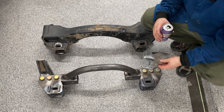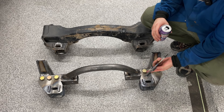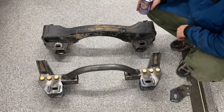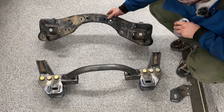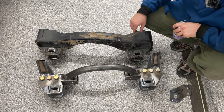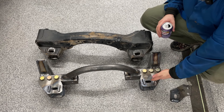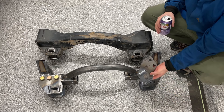This is held on with bolts. This is the rear example, and it will be held on by two bolts just because of access in the back. These things now bend — they take the place of the original cam tab setup. And when these things bend and bend a lot, you can replace it, because this whole subframe yielded and twisted, not just the tab. So if I can focus that bend failure here, I can just unscrew this thing off, bolt it back on, and voila — I have new cam tabs. That's the idea anyway.